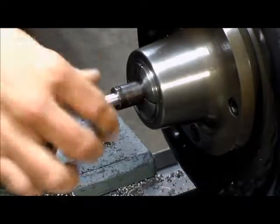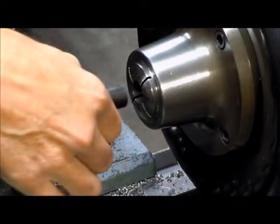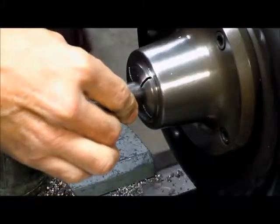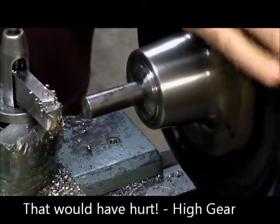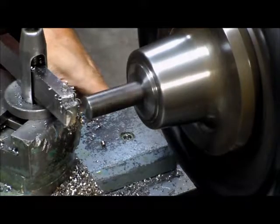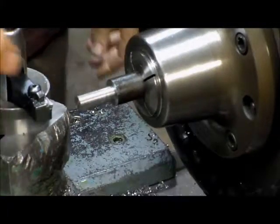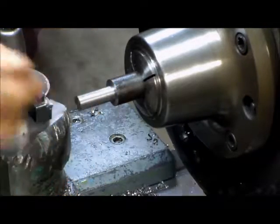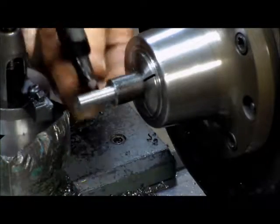And then I'm actually not going to take that down to the proper diameter. I'm going to leave a little bit of stock to run a finishing tool in there. That one comes out. And with the stop, we don't have to change anything. Next step is, now you've got the five pieces. I'm going to make 10 of the bolts.